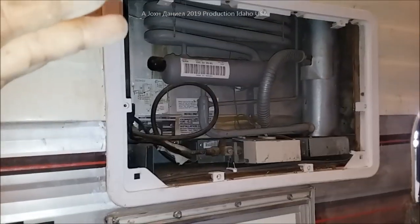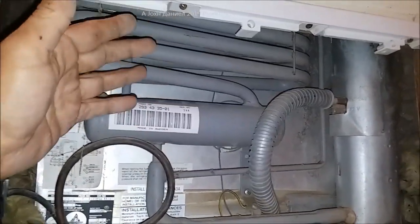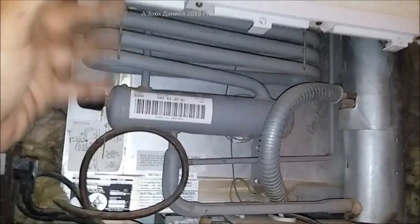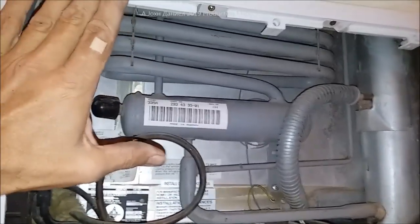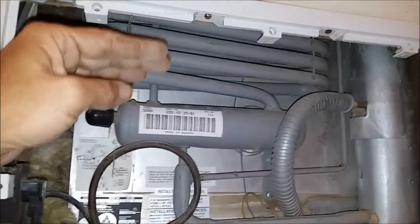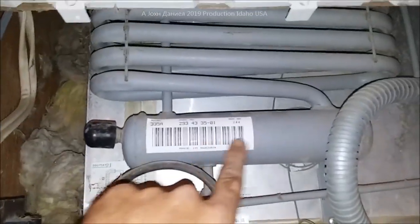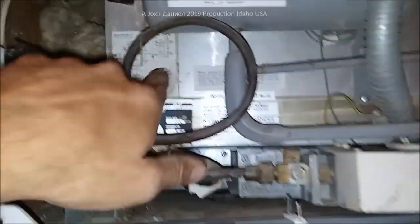Make sure your adjustments give you a temperature range of zero degrees in the freezer area. I usually run them at about 10 degrees down to about negative 5°F — that's the smartest way to go. This one is new and very simple; you can download the PDF on it for more details.